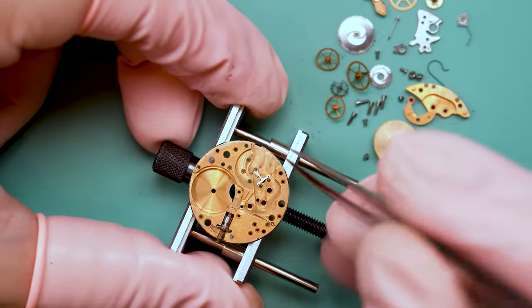The rest of the keyless works comes out without too much drama. But the part I'm a little concerned about is the sliding clutch and what's left of the stem, still rusted into place. We can also take apart the mainspring now and see what's going on in there — I would not assume any water had gotten into it. And it hasn't. This does look like the original mainspring — it's an older style where they're simply round, concentric circles, where newer ones are more like an S-shape. It's apparently more efficient to make them in the newer style. I'll probably try to replace the mainspring just because this one is going to be tired most likely.